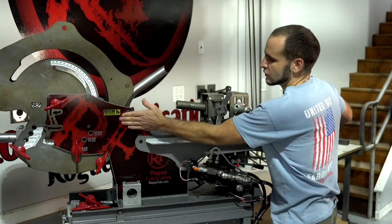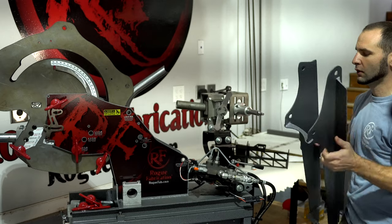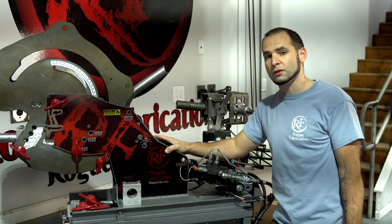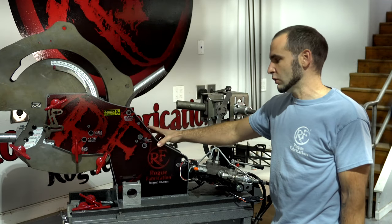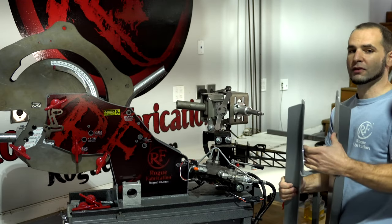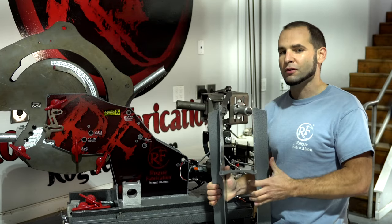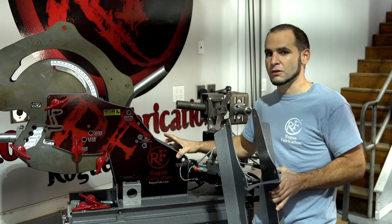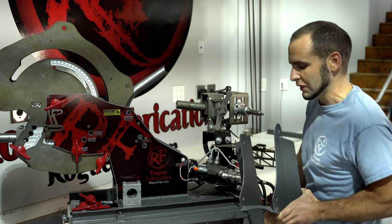This mounts on the outside of both sides of the frame. For reference, the outside of the 625 bender — which is the wider configuration — will be about four and a half inches, actually about twenty thousandths of an inch under that value. The inside of this is basically exactly four and a half inches; they can be five to ten thousandths under that range, but they're going to fit very close to exactly matching the dimensions of the XHD or 625, the thicker frame capacity machine.